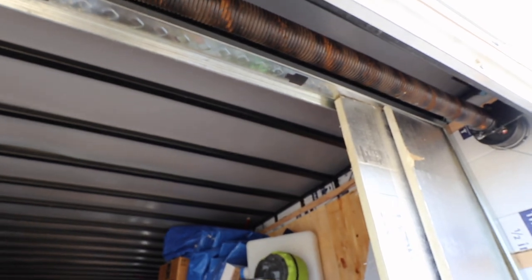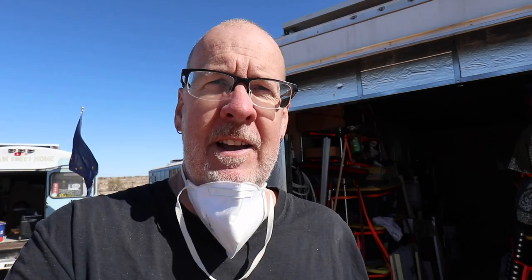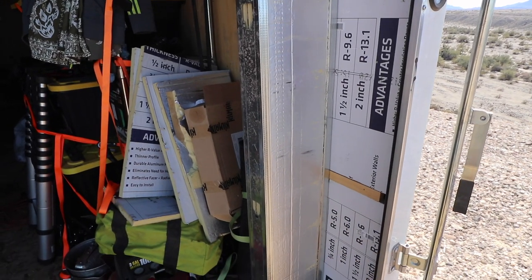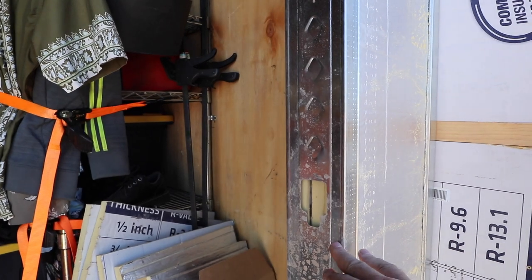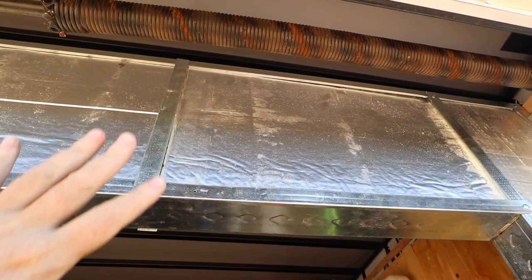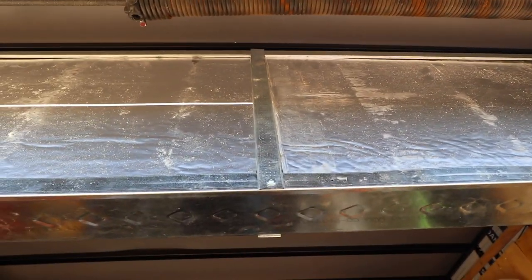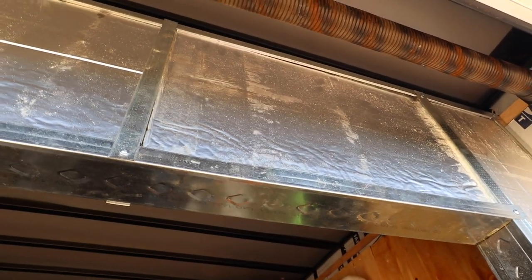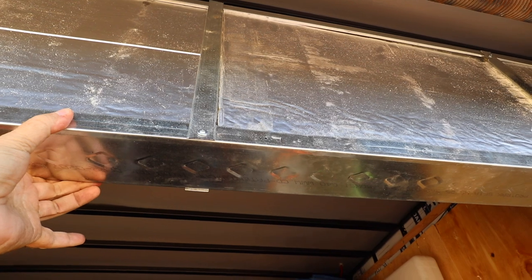I still have to close in the top — that's the section I have to do. Working on getting these three sheets of poly iso into place over here on the right-hand side. It's a few days later since my last video working on the framing for the sliding glass door. Over here you can see the framing I put in on the sides with three inches of poly iso. I finally got in the end cap stud that goes all the way around, and my latest addition is up at the top — a section going over the top of the sliding glass door with extra structural supports and three inches of poly iso up there. These are all steel, traditional stud size, and I double-checked my measurements — everything should fit.